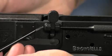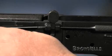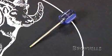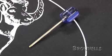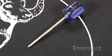For the lower receiver, you'll need a number 3 roll pin punch and holder for bolt catch and trigger guard roll pins. If for some reason you need to disassemble the trigger guard plunger, it requires a number 1 roll pin holder and punch. To assemble the trigger, you'll need a 0.151-inch diameter punch for your trigger and hammer pins. This punch will work for all trigger and hammer pin sizes.